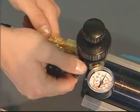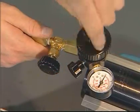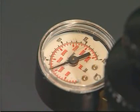Check that both valves on the armature are closed. Now, open the valve inside the gas spring using the smaller of the two knobs. Turn clockwise until the pressure gauge needle begins to move. Continue turning, but no more than another half turn.